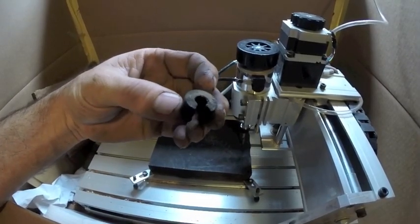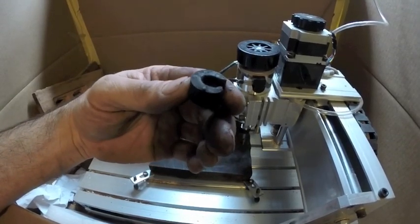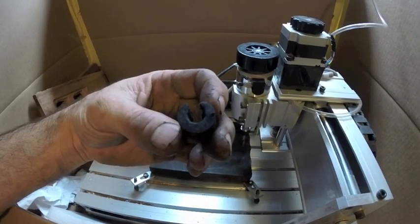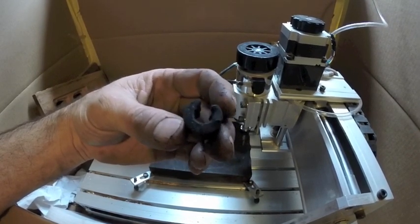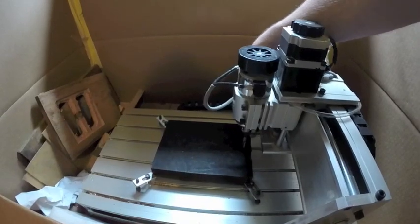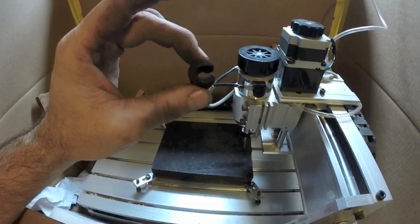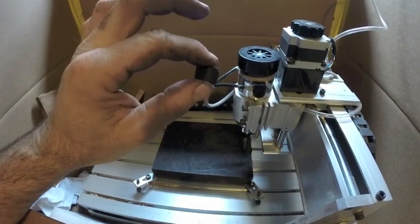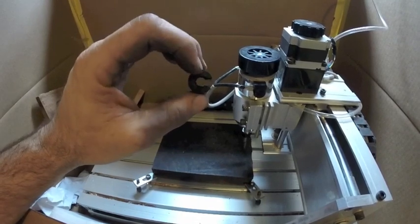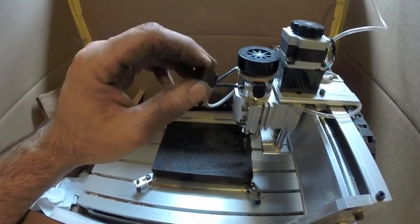Here are the rubber inserts — there are four of them — that go into the crank pulley. These are the shock mounts for the four pins that turn the PTO shaft for the front loader. You can see how much the pins wore out; they're actually C-shaped, they're no longer round. We're looking at a 20mm outer diameter, the pin diameter is 10mm, and the thickness of each one of these gaskets is about 15mm.